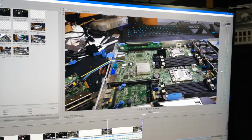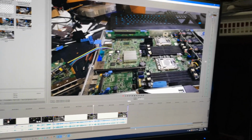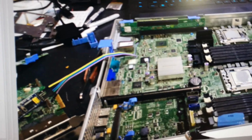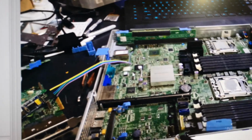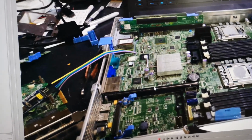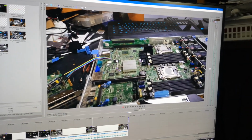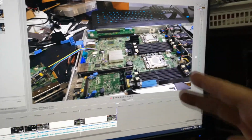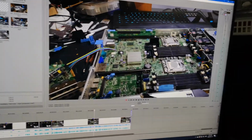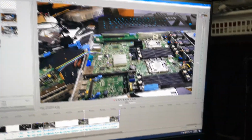So the solution that would work otherwise, though, is you take an Arduino, because it's UART serial. So you wire up the serial port to these pins, and then basically set it up so that when the server powers on, you could have it bridge the 2 pins on the switch contact. So you have it bridge the second switch. You basically time for a known number of seconds how long until you get that prompt to press any key. Then you could release that switch position 2. Then you could just have it press an enter key virtually, and then you could have it put in a command to set the fan speed, and that takes care of the fan speed. And the Arduino would just run that every time you power the server up.